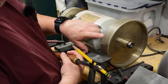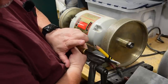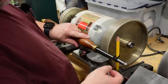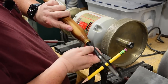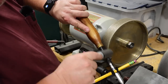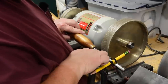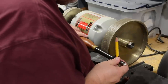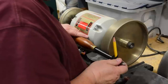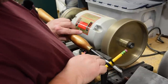I like to use a very coarse wheel, but if all you have is a fine wheel on your other grinder it'll work — it'll just take a little longer and your steel will get a bit hotter. From here, I'm going to eyeball what angle I need to keep my pencil at in order to engage the very center of this section. Mine is black, but if yours isn't you can take a magic marker to highlight it, and to verify my angle I'll rub it back and forth. Once my scratch marks are at dead center, I know my angle is going to be right, and then it's just a matter of grinding it down a little bit at a time, verifying often that you're getting the center.